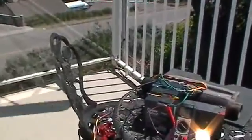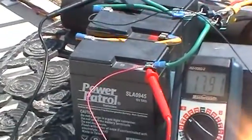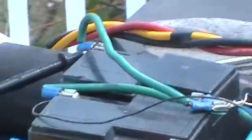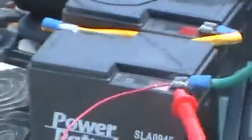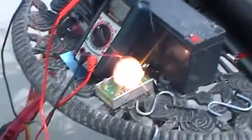Now what I have done is not used all 18 volts that I have available. I am hooked up on that red wire right there and that black wire right there to 12 volts of the 18-volt battery pack. I'm not using that one up there, just these two here. The red and black wire run down to my 50-watt 12-volt bulb. You can see the leads right back here — the red and black wire from the power pack goes to the meter wires.